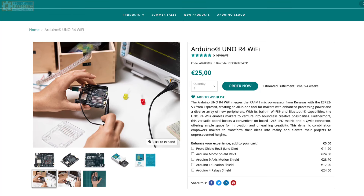There is a feature on the Uno R4 that will help high-speed use cases. The ARM Cortex M4 has a floating point unit for performing calculations with floating point numbers — numbers with decimal points. If you're trying to do some beefy calculations with decimal points, you're in luck. Taking advantage of the FPU is seamless in your code — the compiler sees that you're doing calculations that can leverage the FPU and hands them off to be accelerated.